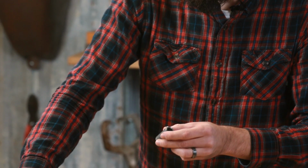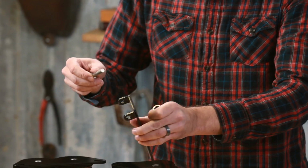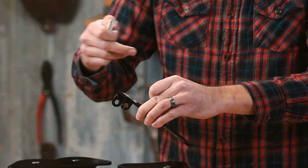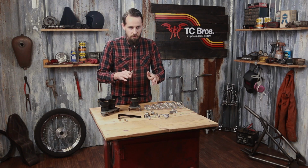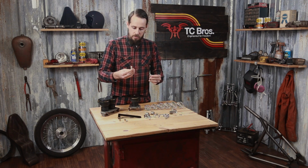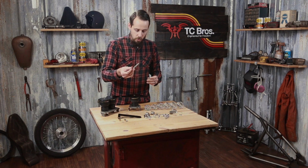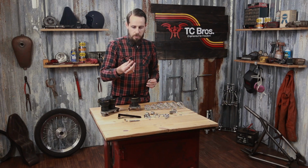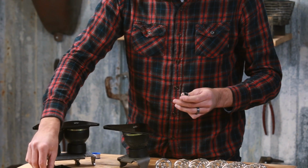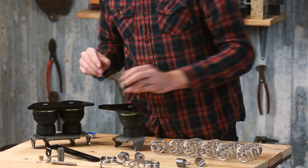Inside this tube, after it's been welded onto your frame, you install oil impregnated bronze bushings into either side, and then you install the stainless steel pivot bolt through the pivot, through the bushings, and put the nut on the end, tighten it down. It's a very squeak-free, long-lasting setup. You don't have to worry about the bolt ever rusting, and should the bushings ever wear out on you down the road, they're inexpensive and easy to replace. That covers the front of the seat.